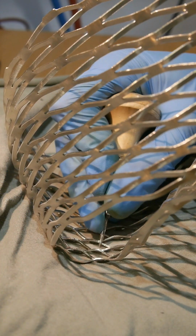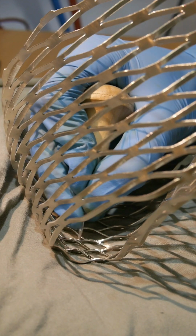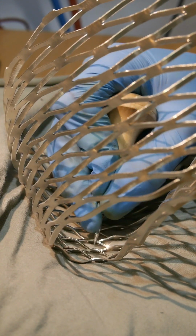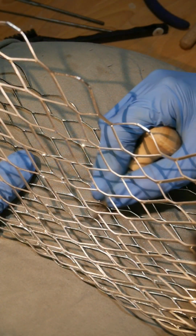Because of its difficult geometry, the only way to polish the edges while leaving the side surfaces matte was by using a burnisher. A burnisher is a hardened and highly polished steel tip to smooth and polish soft precious metals. This works without the use of any polishing compound, just with pressure and maybe a little bit of oil for lubrication.